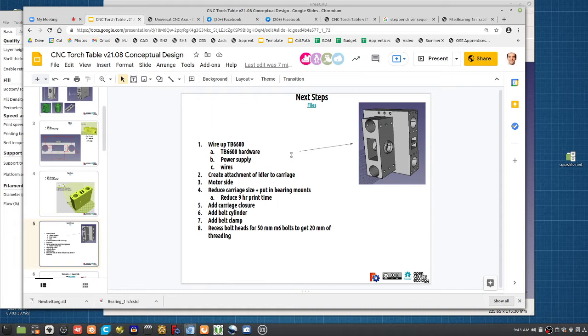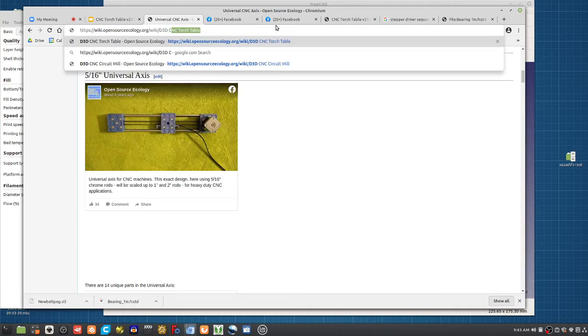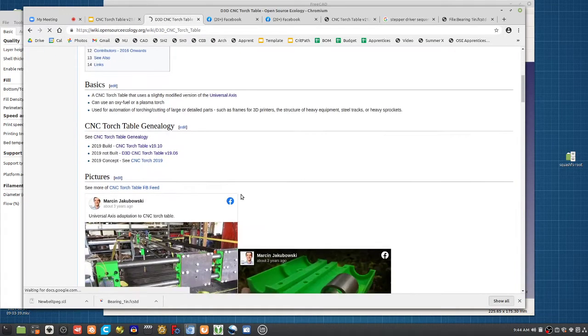On the order of the limit of the one inch axis, you can probably do very easily, I would keep it at 4 feet by 4 feet, and 8 feet tall is easy. If you go to longer lengths, like say you want to do a 1-inch universal axis torch table which is longer than 4 by 4 feet, use hollow rods. They do have 1-inch hollow rod, which is much lighter, because with 1-inch solid rods, they end up sagging. We did a torch table that was like 10 feet long, and to show you that one, the D3D CNC torch table, the one two versions ago, like this one,